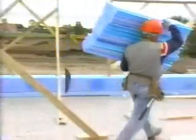Assembling the polystyrene prefabricated sections is surprisingly easy. A polymer T is cast from the same mold as the polystyrene prefabricated section. It acts as a guide when the sections are being assembled. The T is also used as a surface upon which to screw furring.